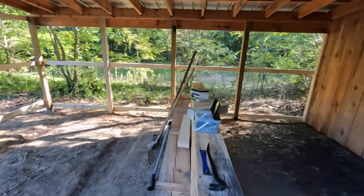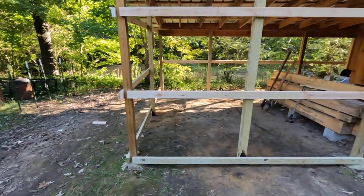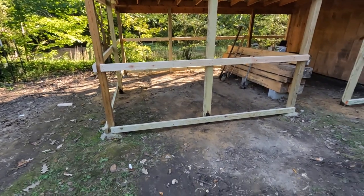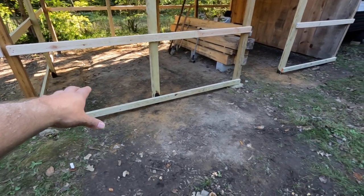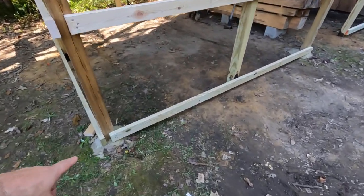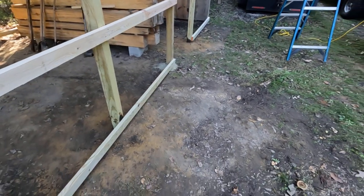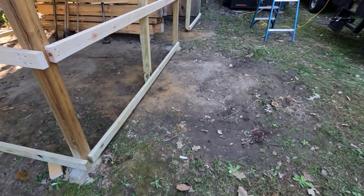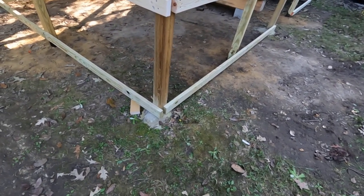It's coming along. I guess tomorrow I'll probably get started on my siding. Right here in the front, I've got water that sometimes runs downhill and it'll run in there some. So I'm going to have to put a drain system — like a French drain — right along this front here. Maybe put some kind of pipe in the ground with holes in it, then put rock on top of it and divert that water off to the side.